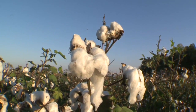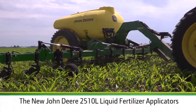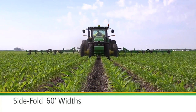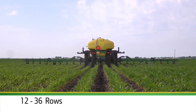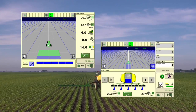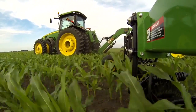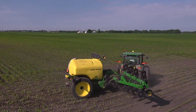If you're a corn or cotton producer looking for a better solution for side dressing, it's time to look at John Deere. Introducing the new John Deere 2510L liquid fertilizer applicators — two models: a vertical fold offering 30 and 40 foot widths, and a side fold for a 60 foot width. Get tank capacity up to 2,400 gallons, coulter spacing from 20 to 40 inches, and row capability from 12 to 36. Wing down pressure delivers consistent, precise soil penetration. John Deere section control and GreenStar rate controller deliver precision fertilizer application with minimal costly overlaps.